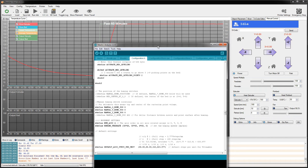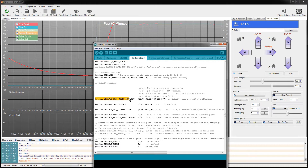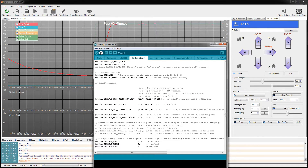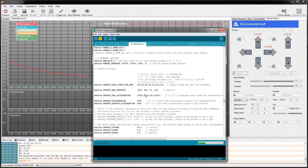Mine is set at 170, so I've got this just at 180 even though it's all disconnected — it's easier than changing the software. What I'm looking for here is the default steps per unit. I'll go ahead and put this back how it was, save that, disconnect, and disable the heaters. I've saved that back into my file — compiling and uploading the firmware to the chip. This number is just a guess; it came from somebody else's number online who had a similar extruder.